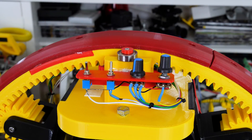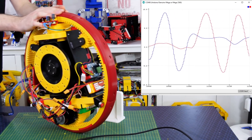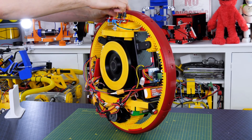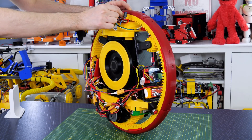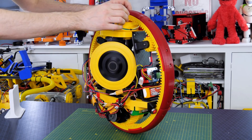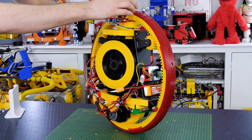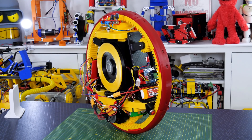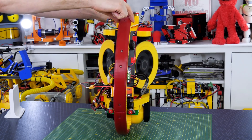I've got various knobs and switches which allow me to tune the balancing set point and turn functions on and off. The inertial measurement unit measures in two axes, giving me the two angles front-to-back and side-to-side, so we can process that data with PID controllers and try and keep it balanced. We have to turn up the speed on those ESCs gradually because they're speed controllers and not current controllers — if we suddenly increase the speed they draw a huge amount of current and they're rated at 120 amps which would probably burn the motors out. Once up to speed we can set the set point and get it balancing in the middle. The gyros can't exert a force unless they're actually moving so we have to be careful they don't run to their end stops, otherwise they'll stop and the thing won't balance anymore.